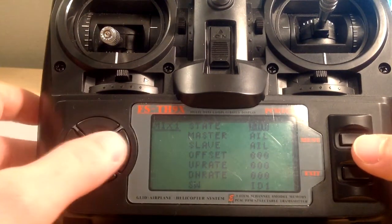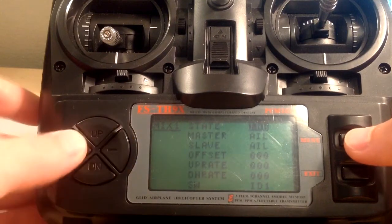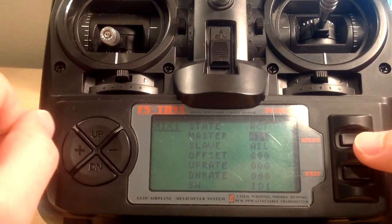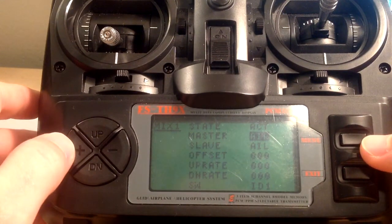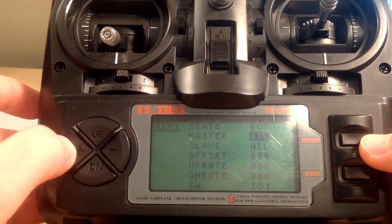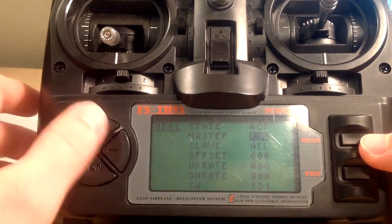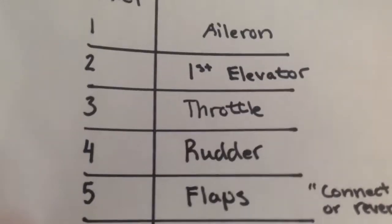Okay, I'm going to hit Mix 1. I'm going to activate this. Okay, so what you're going to do is you want the master to be our elevator. So see, it's an aileron. That's our first channel. Second channel is the elevator. Third channel throttle. 4th channel rudder. So that corresponds with what we have our channels set to. So that should make sense.